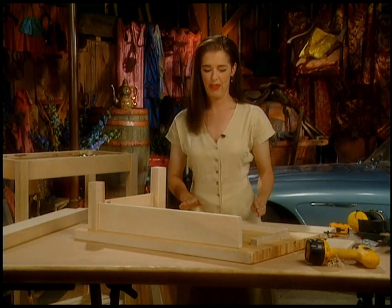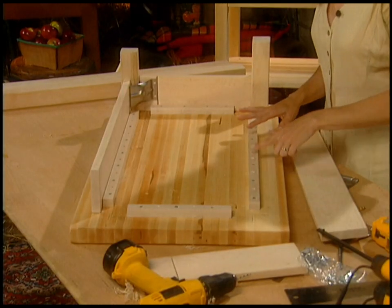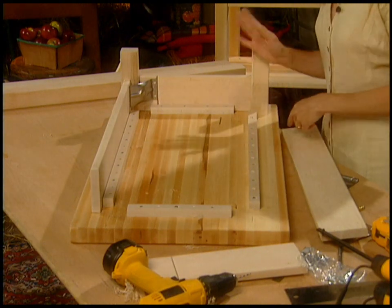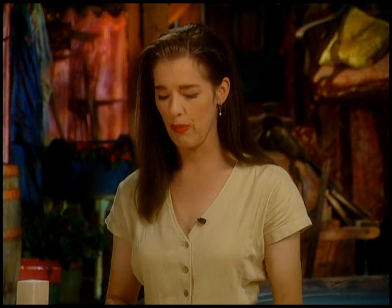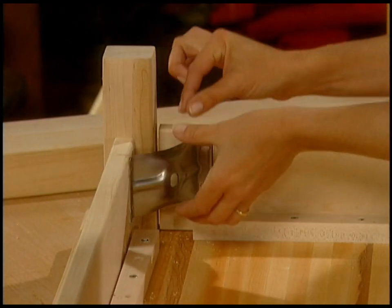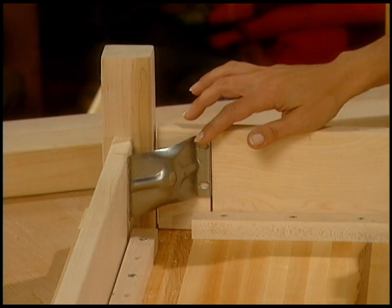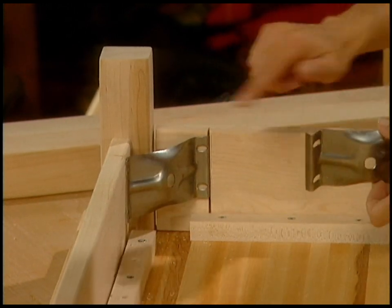The strips are in. I really overdid it with the number of holes, so I just used every other hole. Now I'm at the point of working with the magical hardware - the brackets. This thing just slides into place, so you have to cut slots for it because of the way they're made. To find the marks for where to slide them in, you put your apron bits up against the strips and put your leg in place on the lines you marked earlier at the very beginning.